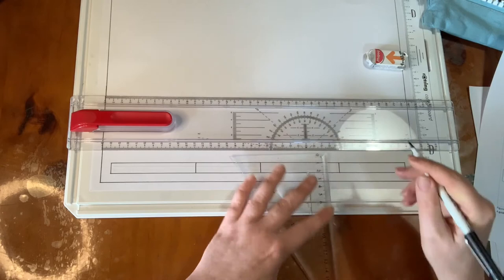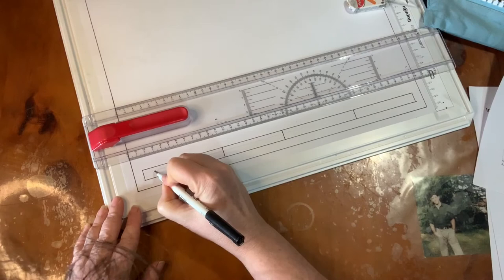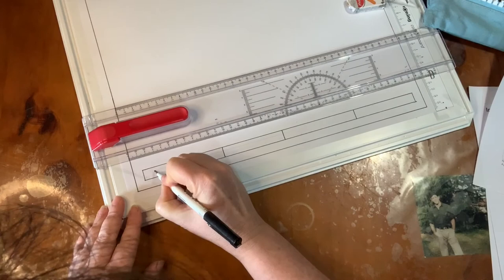Now, lettering is something that you need to factor in as well. When you're doing your lettering on your drawing, you need to make sure you're using capital letters. There's no ifs or buts or maybes. You need to use capital letters, and that goes between the 3, the 7, and the 3 millimeters. So in here is our student name.